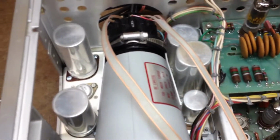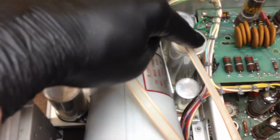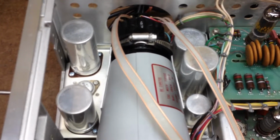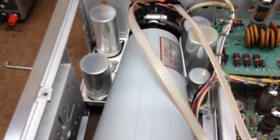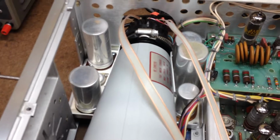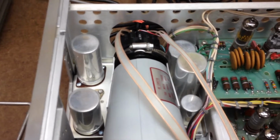and back here you see the can capacitors that I restuffed. That's these guys, 1, 2, 3, 4, and 5. Those are the ones that I cut and put new capacitors inside, and you could tell, I mean, they still look original. You would never know unless you investigated it. Of course, no one really ever sees that anyhow once the covers are on, but I like to keep the look original on something like this.